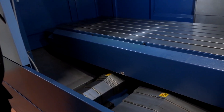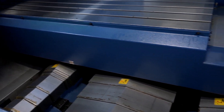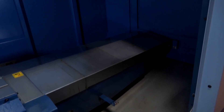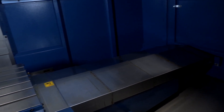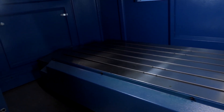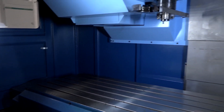Yes, this is the biggest three-axis vertical that we do. The machine has a maximum table weight of two tonnes, so obviously you can put some very large parts on there. But to support the table over such a large expanse of one and a half metres, we need to add an extra set of rails under the centre, just to give it the rigidity that it needs.